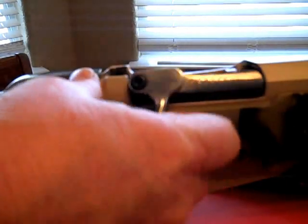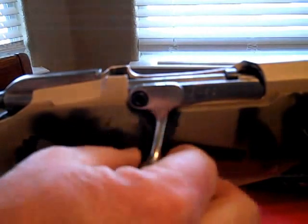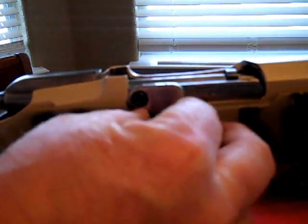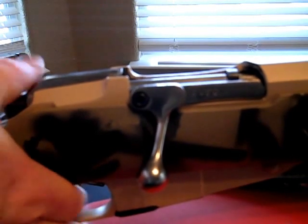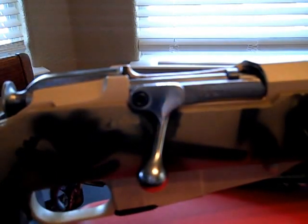And you want the head space on this bolt to be perfect. So don't get in a hurry here. Go ahead and keep testing it. Make sure that you can slip a little piece of paper behind that so you have this bolt going all the way down, so that you got your head spacing proper in the bolt. So once you're done, I think it works great.